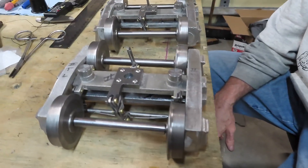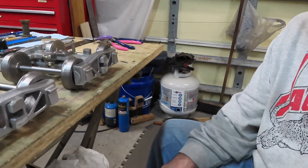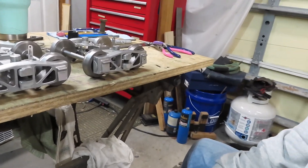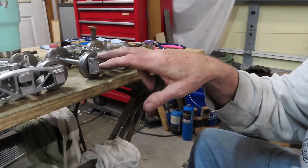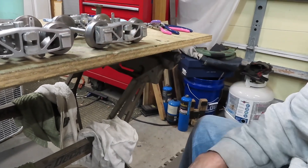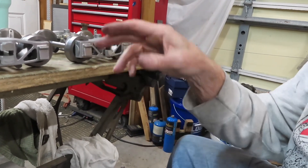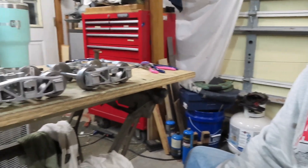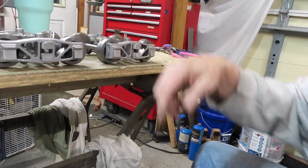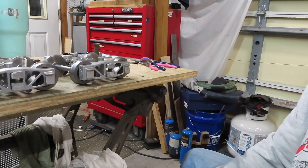I'm really excited about getting them done this far. There are a couple of small things I want to do to each one, so I made a finishing items list. I'll take them apart carefully, keep the pieces together, then do the finishing. I'm going to paint the outer castings black, and for the inside of the wheels I'll just brush paint those while they're off — pull a Keith Appleton and brush paint. Once the paint is dry I can put them back together, Loctite the wheels on the axles, and put the assemblies together for good. I might also put some gun blue on the steel components as a rust preventive.